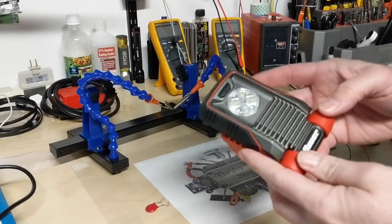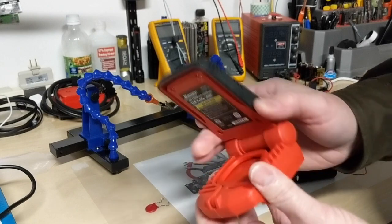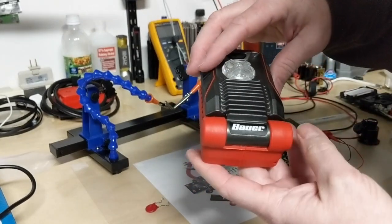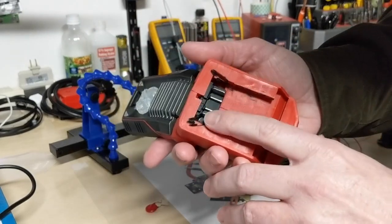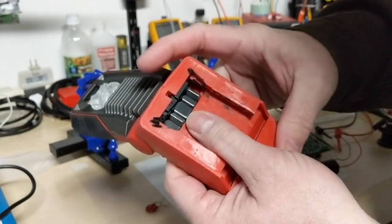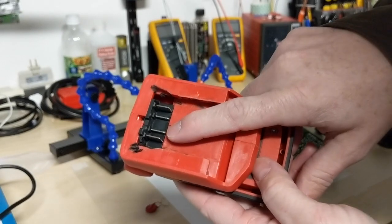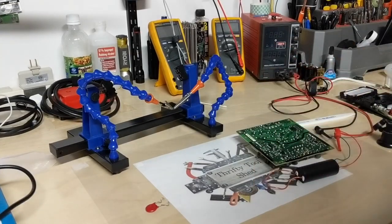Next up on the weekly 'what is it' — I have this little flashlight sold at Harbor Freight. I saw it and thought it looked good, and I'm actually very impressed with it. I was going to see if I could make it fit a standard battery pack that I had. I don't have the Harbor Freight brand battery, but I do have a lot of 20-volt cordless stuff. I know this is the 20-volt connection, but there are two more connections here and one of them is actually connected inside as well. If I put 20 volts across it, it doesn't light up. So in the next weekly 'what is it,' we'll look at this terminal — what is it and how do we get it to light up without the right battery connection? Hope you enjoyed the video. If you liked it, give it a thumbs up, please subscribe, and thanks for watching.